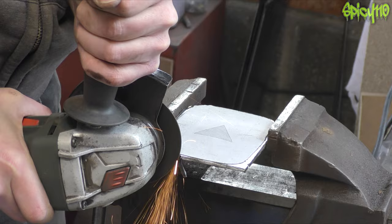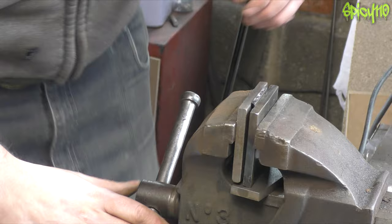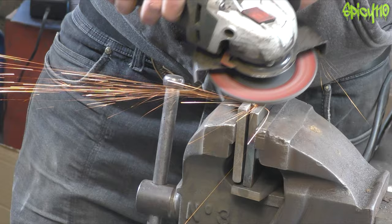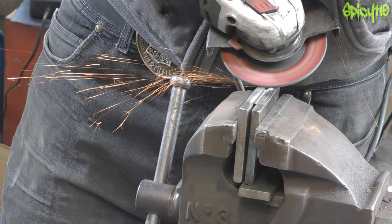Trimming little pieces off where I can, then going back the other way and taking some of those teeth out. For the triangle, I wanted to make sure it was nice and square, so I used some off-cuts of steel as weights when welding — used the edge as a guide, clamped it in place, and did each side alternately, lining up the edge of the guide with the template stuck to the metal. It gave me a nice flat edge all the way around — kind of pointlessly, because I ended up welding all the way around it anyway.